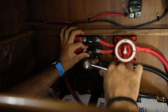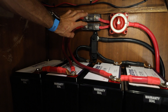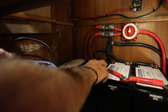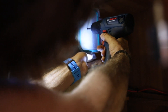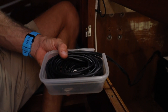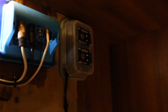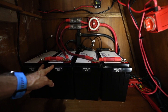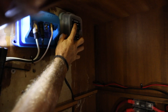The bulk of the installation is now complete. We have our four batteries wired in parallel, two and two. They come up through the positive and negative cables to fuses, then to a master on/off switch, and then down to the rest of the system. Since the on/off switches for at least two of the batteries are covered up by the DC negative cables, we're going to install the remote on/off cables on this side wall in our handy Tupperware container. Each one has a simple four-pin connector that connects right to the top of the batteries, enabling us to remotely turn the batteries on and off as well as see when they're charging or discharging.